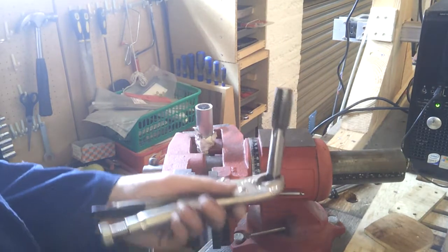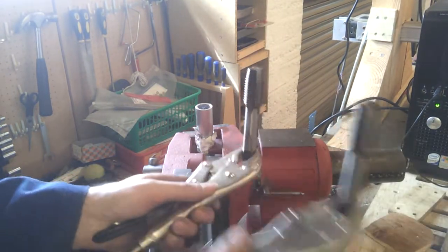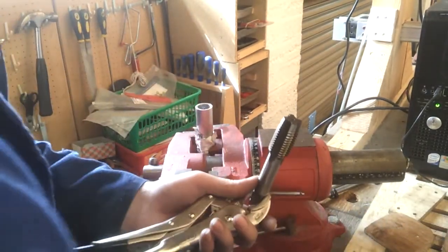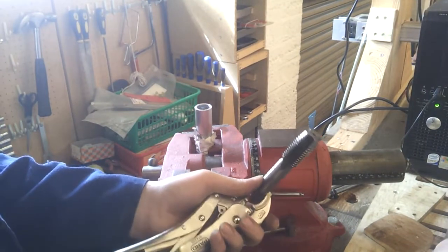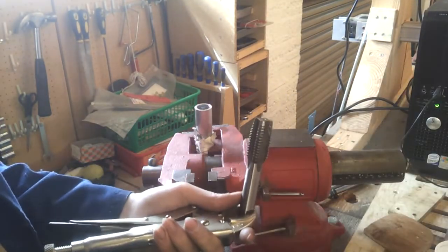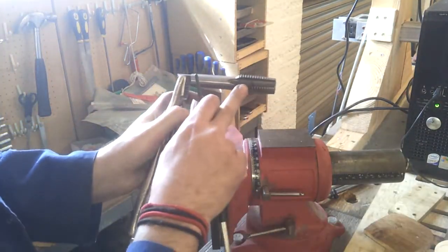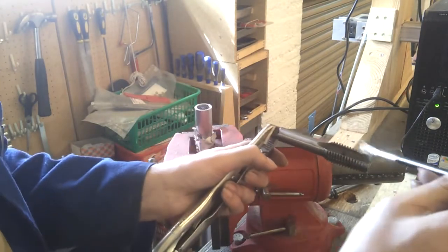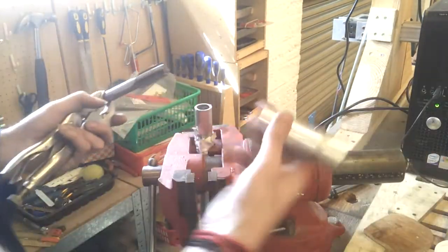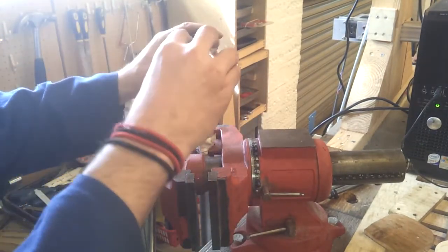Since I'm lacking a tap wrench of adequate proportions, I've armed myself with a suite of pipe wrenches because I'm not going to splash out and buy a tap wrench especially for the job. I'll lubricate these up - that's the second one; I actually want the taper. I've marked on this the depth I want to go to, so I'll give it a bit of cutting fluid, drop the sleeve on, and see if we can't get this going.